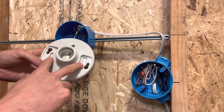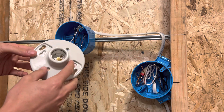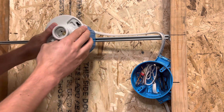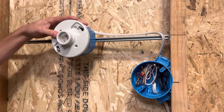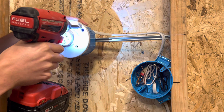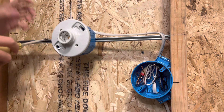If you have smaller holes, you can knock out the smaller ones. This is a porcelain one — there are several different holes you can use. I'm just using the outside holes on a four-row box. Fold the wires in there nicely, make sure nothing is touching the ground wire, then flip it right over the screws and tighten it down. Don't over-tighten it, because it could shatter — it is fragile looking.